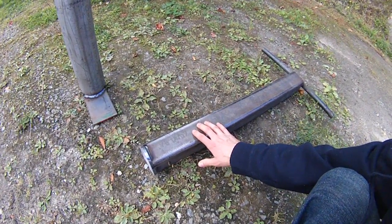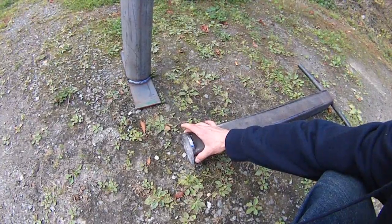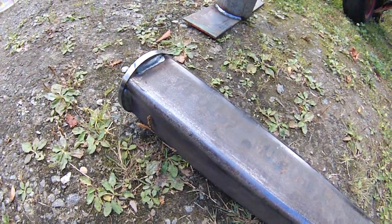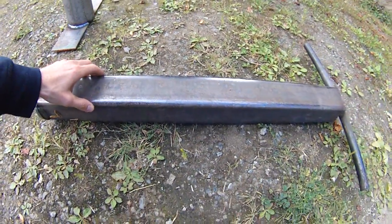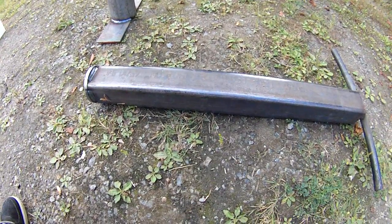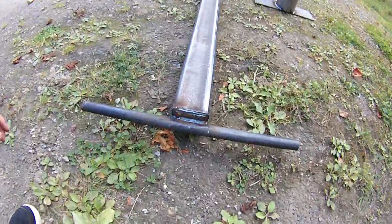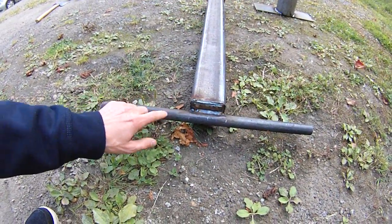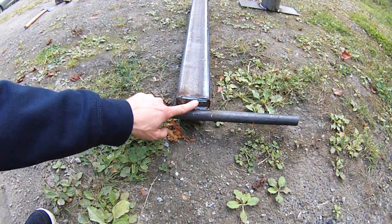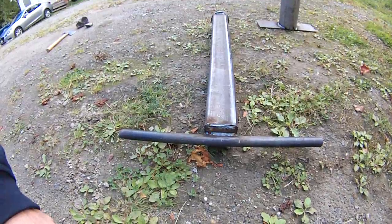Breaking it down, this is just a piece of solid round stock that's been cut — just a slab of it, right about a quarter inch to three-eighths wide. Welded on is HSS steel square tubing. You could use round as well, but I found it easier to weld with it being square. The top has a handle that's just a solid round bar welded on, and the end is capped first so I could weld to a piece of plate — probably about a quarter inch thick cap. The HSS is probably about quarter inch thick wall as well, if not a little better.